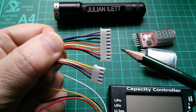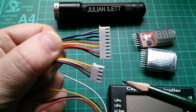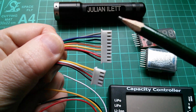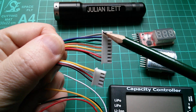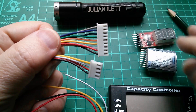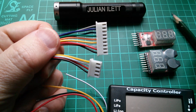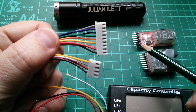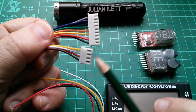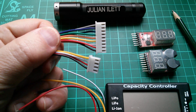As far as I remember from my experiments with the Turnigy charger, this black wire at the end isn't negative - it's not the most negative point of the battery. It's actually this other one at the other end, so gray on this lead and yellow on this one, so it's all a bit inconsistent. Also the pin assignments on these two differ - the lower pin here is the most negative point but on this one it's the upper pin, so everything's very inconsistent and I want to do some experimenting just to build up some confidence.